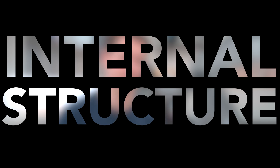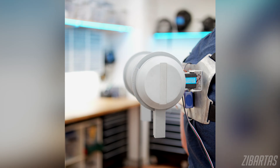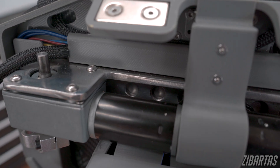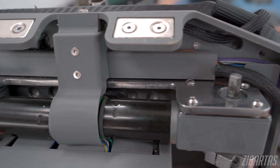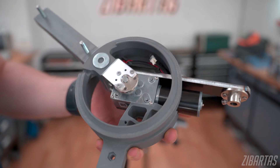The internal structure is much different from the first few iterations. I also made an entirely new backplate to help with stability and weight distribution. The larger contact area is not only more comfortable to wear, it also offers more vibration dampening. Instead of the motors being bolted to the backplate directly, they're now bolted to a solid steel L-profile, which is heavy but also very stiff. This absorbs flexion much better than bare aluminum, and I removed some material to save weight. The parts connecting the spreading motors to the elevating motors are also solid steel.